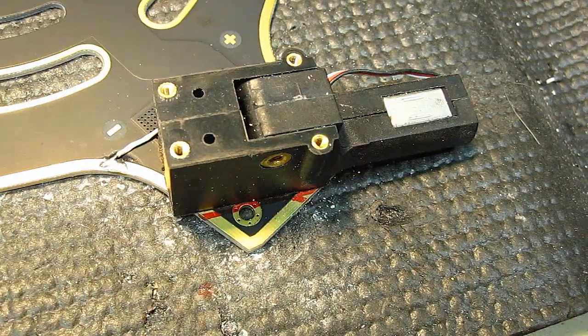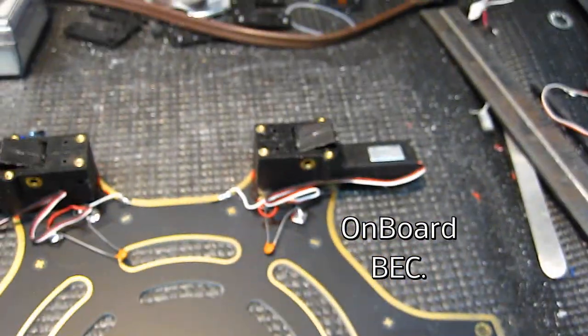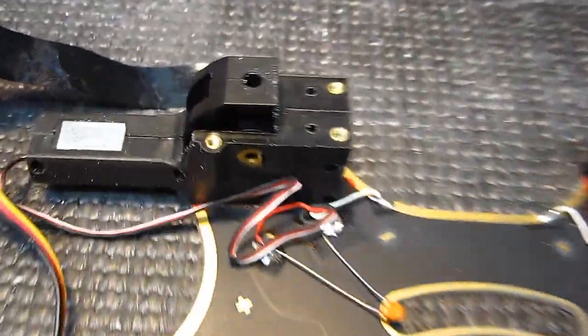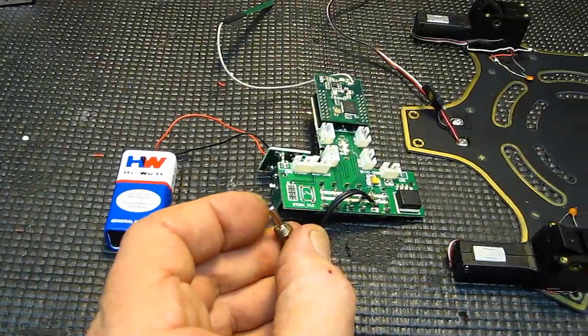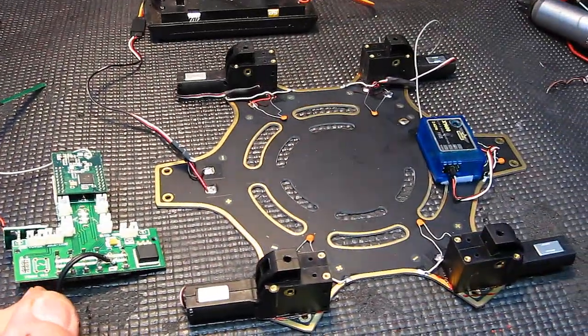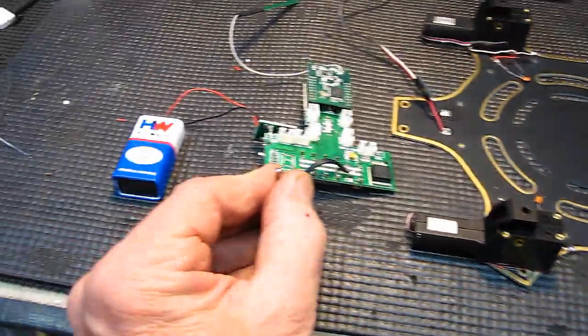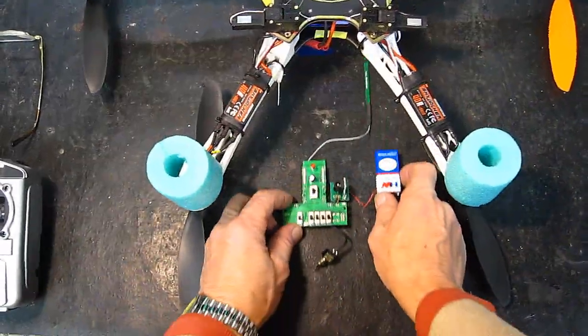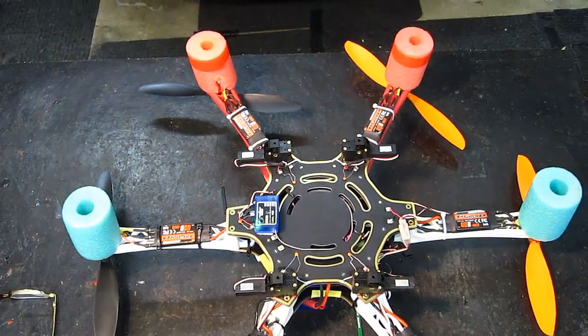As you can see, I'm running this off the power from the onboard BEC on the bird. That's not the ideal way, but it is how I first tested it. I'm going to show you how I made my own onboard power supply for the whole unit in a minute. Needing only a simple one-channel radio to run the gear, I'm actually using a four-channel receiver so I can add three more channels — like camera tilt, angle, etc. — not just the gear, since the camera mount is also on the unit.